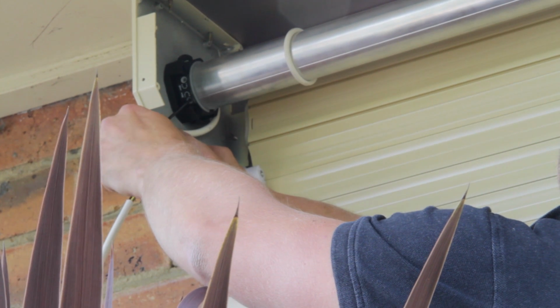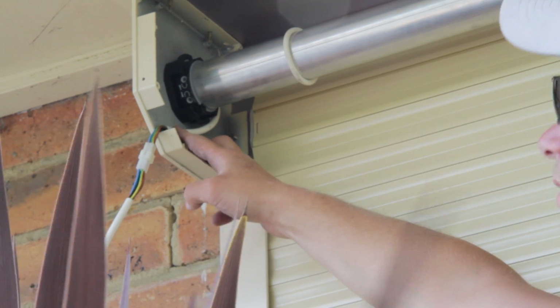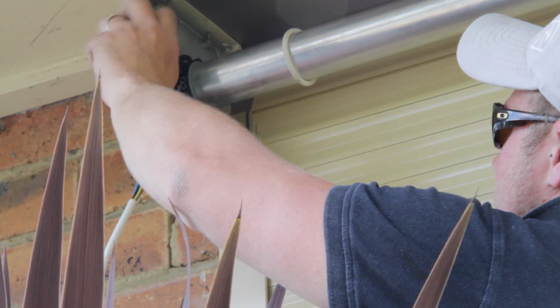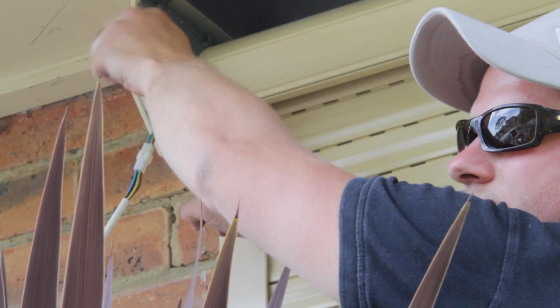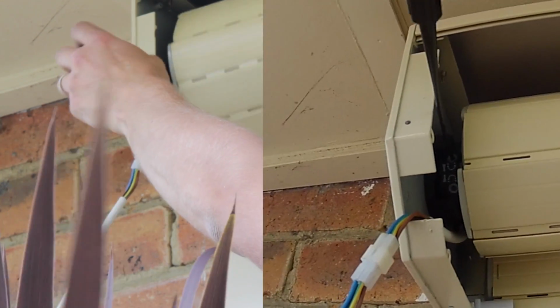You'll need to obtain a test kit from Shutter Components Australia. This allows you to safely control the motor up and down while setting the limits. Drive the motor upwards, noting that there are little plus and minus symbols on the head of the motor, indicating your ability to increase or decrease the distance of the up or down limits. For more information, see the motor instruction booklet.